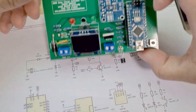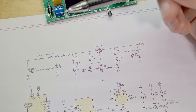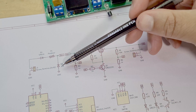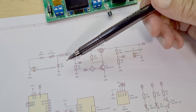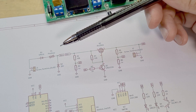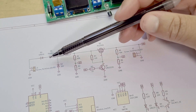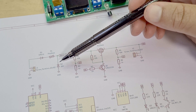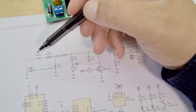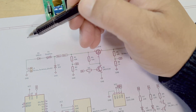Here is a 30-volt zener diode. If for whatever reason the input reaches above 30 volts, that could destroy the Arduino. The Arduino is kind of protected but 30 volts is way too high. If there was a lightning strike and the voltage peaked to like 40 volts, instead of coming in to my current sensor it gets sent straight through to ground. So we have back-current protection, short circuit protection, and high-voltage protection - this whole section is our protection circuit.